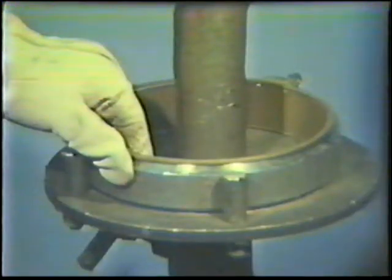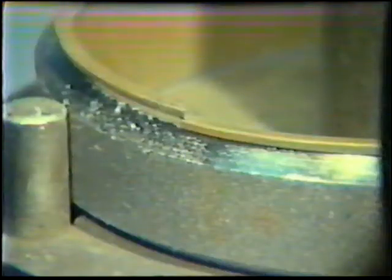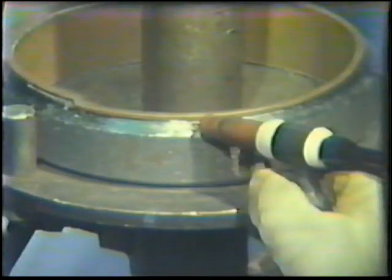Place the insert in the end of one of the prepared joints. Note that the insert is slightly larger than the pipe, which will produce some overlap. The fit-up should be as accurate as possible. Make a small tack weld within 2 inches of the ends of the insert. This tack weld is made without filler metal and joins the insert to the joint bevel. Start the arc on the bevel and melt a small portion of the bevel into the insert.